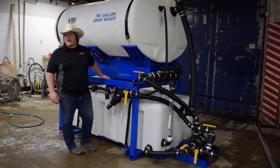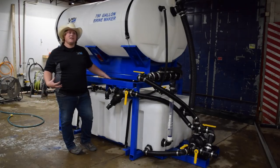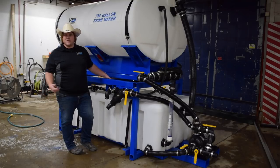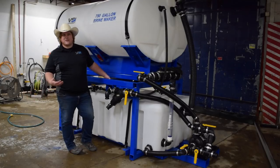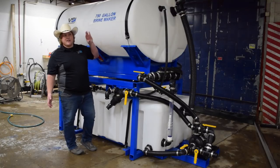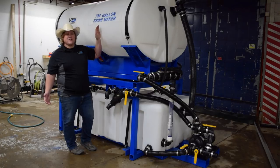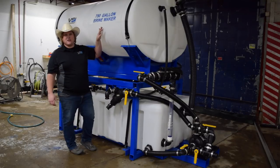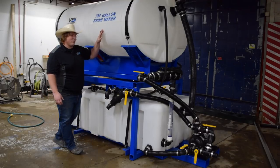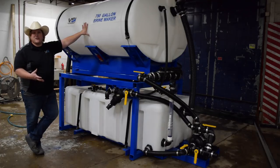A lot of guys will ask how many times a year you have to clean out your brine maker. That's completely dependent on the cleanliness of your salt. At our operation, we have pretty clean salt — we only clean ours out one or two times a year and we're doing half a million gallons plus per year. I've also worked with companies that had such dirty salt that they had to clean out their brine maker after every 100,000 gallons or so. Just monitor what's going on. If after draining the water out of your top tank there's all black sediment and goo left behind, it's probably time to clean it out. If your brine is mixing really slowly and there's a proper amount of salt in there, you may have a lot of sediment plugging up your agitation system.